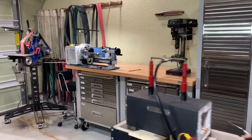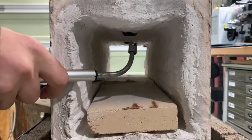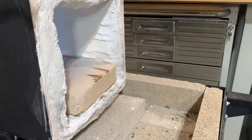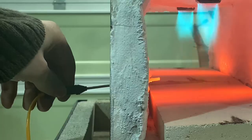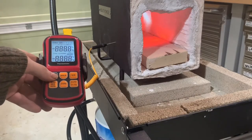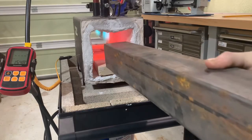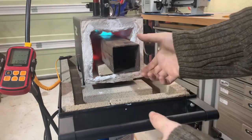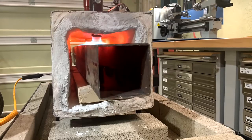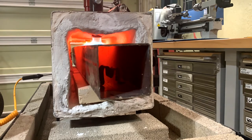This is my new Hell's Forge — you can see me setting it up in a video from a few months ago. It's just a propane forge and we're going to use that to first normalize the blade. Normalizing allows the crystalline structure of the steel to become more regular, which reduces the chance of stress fractures and warps when we quench. In the open forge there are hot spots and cool spots, so I'm adding a steel pipe to give us a chamber with a more homogenous temperature.